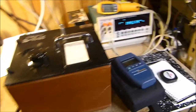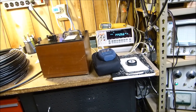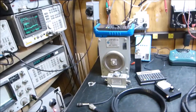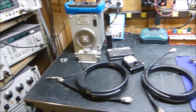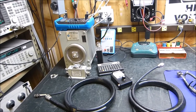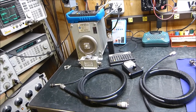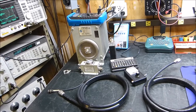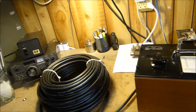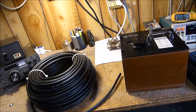One other challenge is the radiation resistance of your antenna. Theoretically, and everyone agrees, the radiation resistance of a dipole is around 73 ohms. For practical purposes I think the radiation resistance is essentially equal to the R part of the complex impedance. In my case it ends up being about 65 ohms — I've measured it over and over with different meters and it just ends up there. I'm perfectly happy with it.